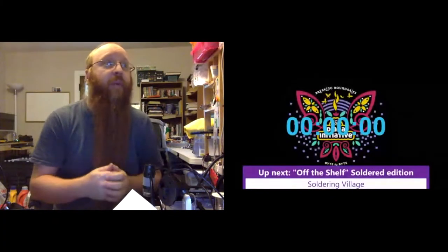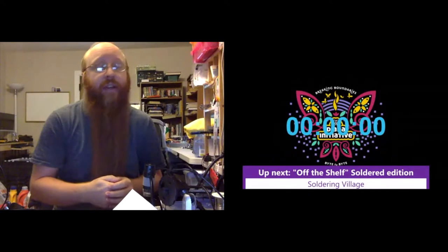After we get that flow, we're going to want to remove the solder, but we're going to want to leave the heat there for a second, and that will allow the heat to homogenize the solder all the way through, and it'll give you a really good connection.